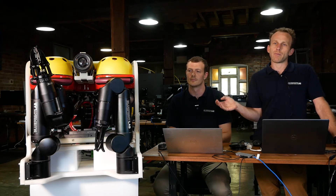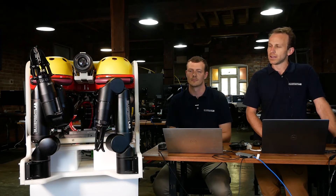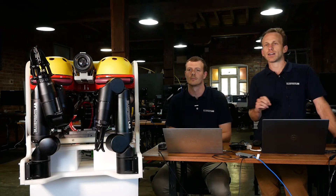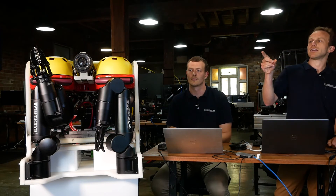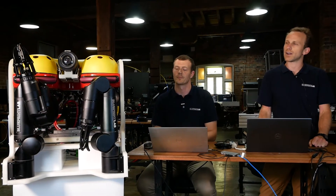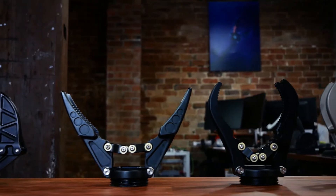What's also different if you're coming from a background in hydraulic manipulators is that the Bravo is a fully integrated system. It's got all its processing on board, all its power management on board. You essentially plug in a power connector and a comms connector, plug that into the vehicle, and that's it. There's no bottle, there's no hydraulic pumps. What you see on the front in the manipulator is the complete package. There are no external leads apart from the cables that connect to it at the base. On this one we've got a quad overlapping JAWS set, and on the seven function there's a parallel JAWS set. We make a large array of different JAWS sets that's continually expanding depending on customer requirements.